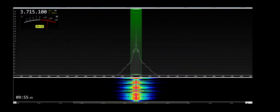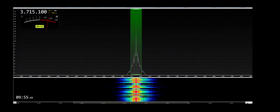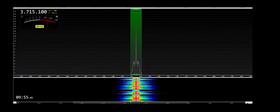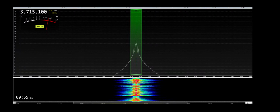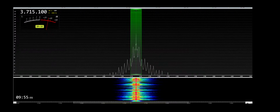And Gary, I think the level pot's probably a good idea. It doesn't make sense why Elmac didn't put one in to begin with. I never did think detuning the grid current was a good idea to reduce it anyway. And that'd probably cure all kinds of problems to put that pot in.